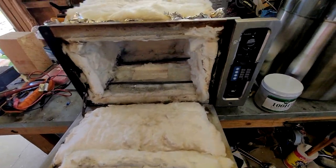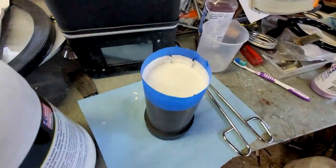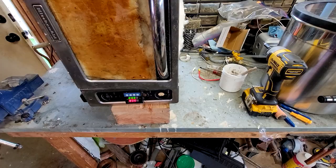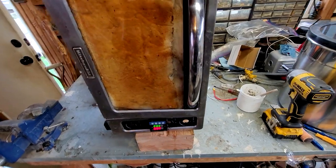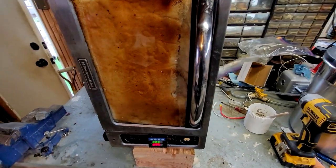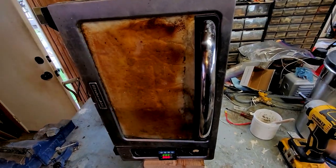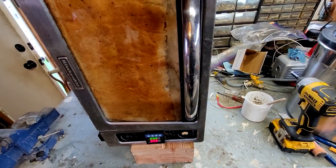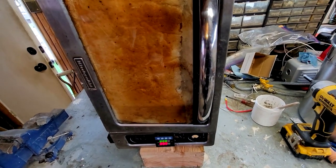And then the mold is drying right now. I think it's just about dry, and then I'll stick it in there for the burnout. Good morning, boys and girls. It's the next morning. Didn't have enough time to start the burnout yesterday. And I applied all the HT100, which you need to let kind of dry. So I started the burnout process this morning.